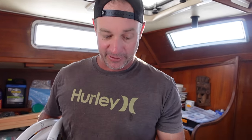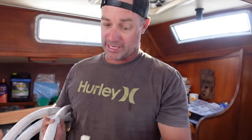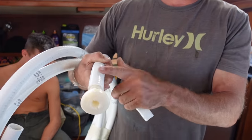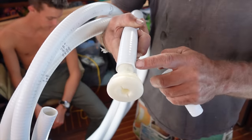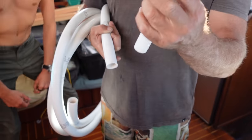What I did find — like a lot of things on boats — things are done the wrong way. It's not always the person's fault. Depending on your cruising areas, sometimes you're very limited to what you can get, so you make do. In this case, this person had a three-quarter inch fitting for the water tank and the pipe actually went over it — the water was just running out the thread.